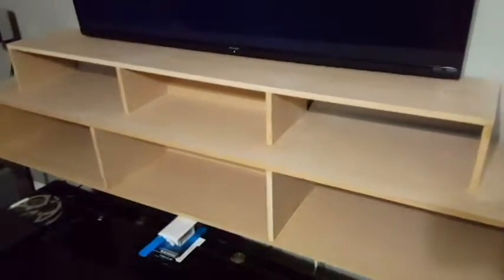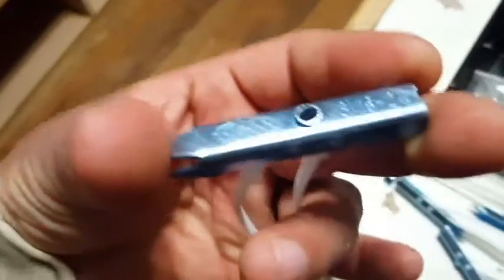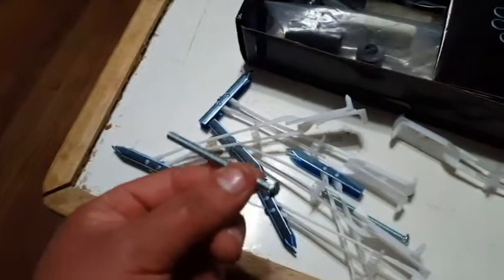While it was up there I pre-drilled some 3/16-inch holes through the back of that area. Now I'm going to use some wall braces originally made for stucco work. You drill a half-inch hole, stick this in, and it creates a brace with thread inside. Then you simply put a bolt through and it holds it up. I'll go ahead and do that now to mount it — actually the same type I already used for the TV mount.